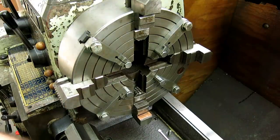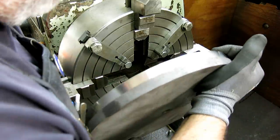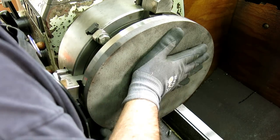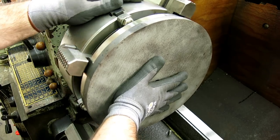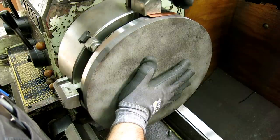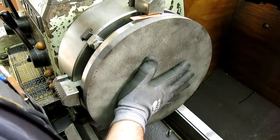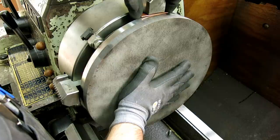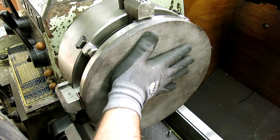Alright, let's put our first copper piece in there. We don't want to mar the finish. Alright. Okay. Let's go there. Slip one in right here. And then this will leave enough hanging out that I should be able to get the indicator in there. That's the other thing. So you don't want these sticking out. You want them kind of behind the front edge of the jaw there. So let me put a little grip on that. Okay, so now it's not going to fall out on me.